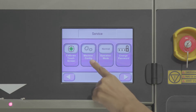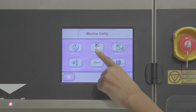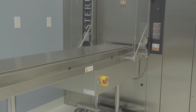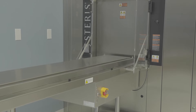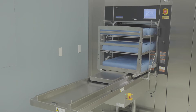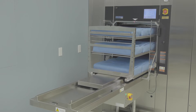Your A-LIS will be configured during installation. The A-LIS features a two-way motor and can be used with single or double door sterilizers. Double doors can be interlocked to ensure only one can be open at a time. A barcode scanner may be used to automatically select the cycle. The A-LIS will be set up to either manually load and automatically unload, or automatically load and automatically unload.